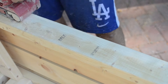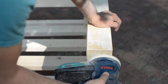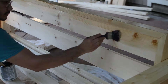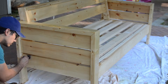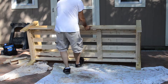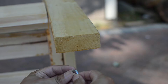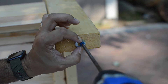After all this I sanded off the printing and rough spots using a belt sander, then used finer grit sandpaper to finish the sanding. After sanding was complete I wiped off the dust and added a coat of spar urethane. I let it dry for a day and before the second coat used fine grit sandpaper to remove any small bumps. For the bottom of the legs I improvised and used a couple of washers on the screw instead of furniture nail-on glides. The next day I came back with the third and final coat.